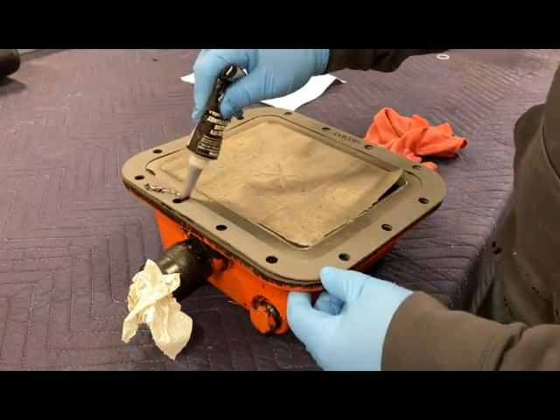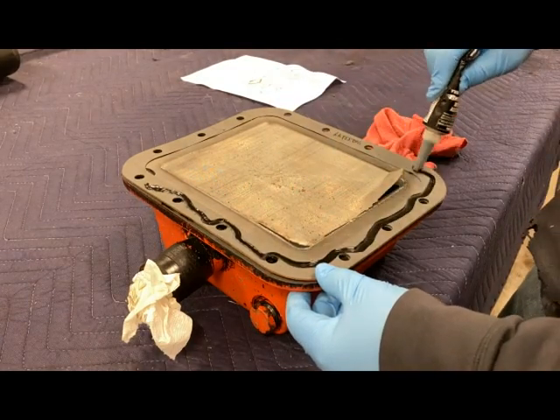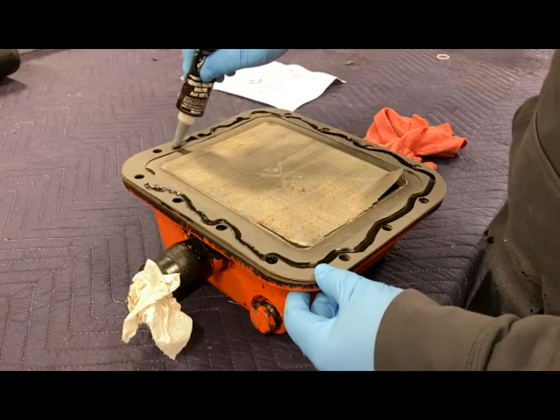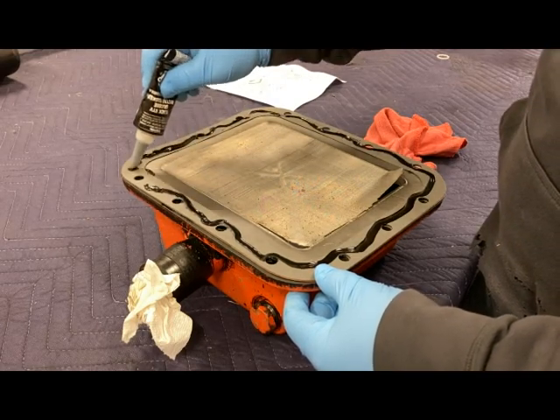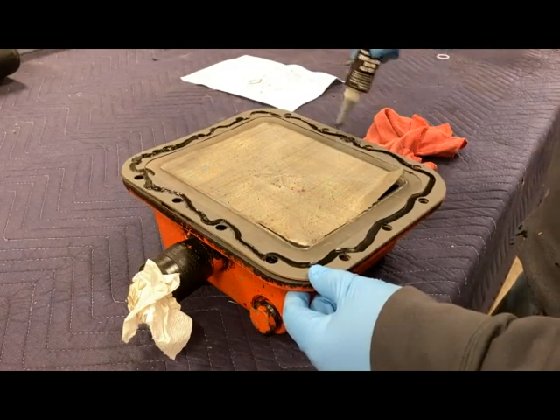I'll set the screen on there and move it around a bit. Then one more layer of Permatex on the screen body, then pick the next gasket and get it moved into place — kind of mushroom it around so it's dispersing the Permatex. Last, we'll put another quick round of Permatex, and this will be the portion that bolts up to the bottom of the tractor.